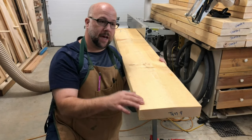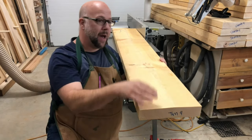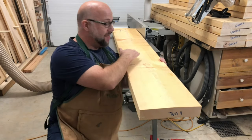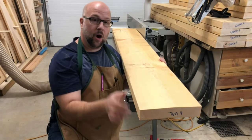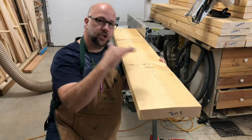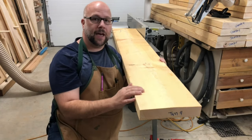That's the same as when the board is warped along its length. You want the front and the back supported rather than the center of the board, because you want to start trimming off the bottom of each side, and eventually as you push it more and more through the jointer, it will start to flatten out. You'll eventually get that flat surface.